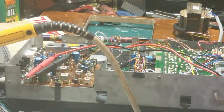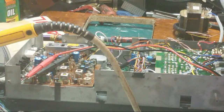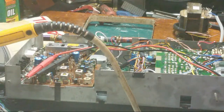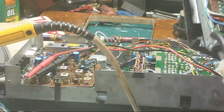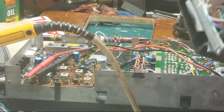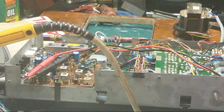So we'll look at that side of the diode in that one. I have to take this one apart. Oh no, it's only apart. There's a diode. Yes, there should be. Should be a diode on the rectifier there, ZD. That one there, I wonder if that's gone. And that should be on that side of the capacitor. Just there. There's the cap, there's a diode. Let's check that.